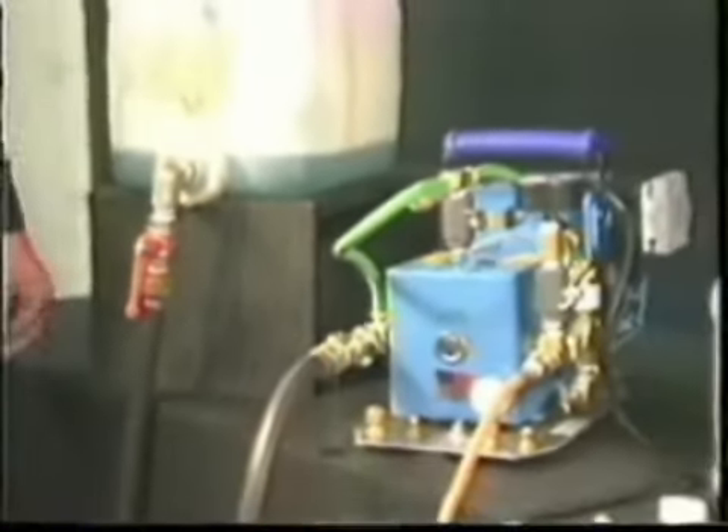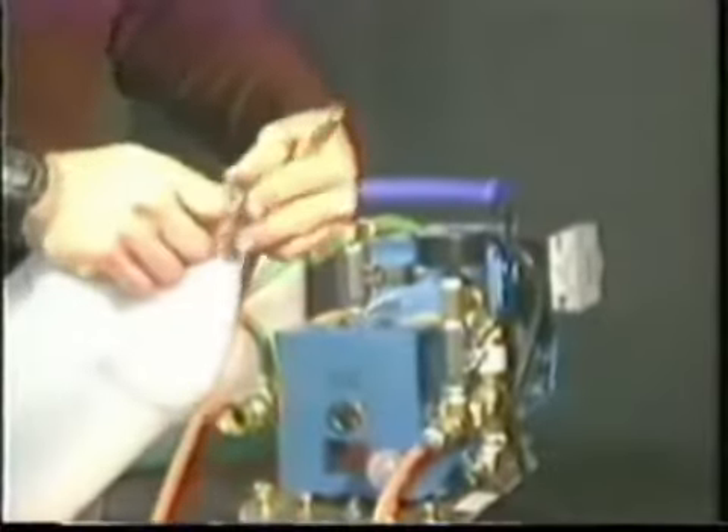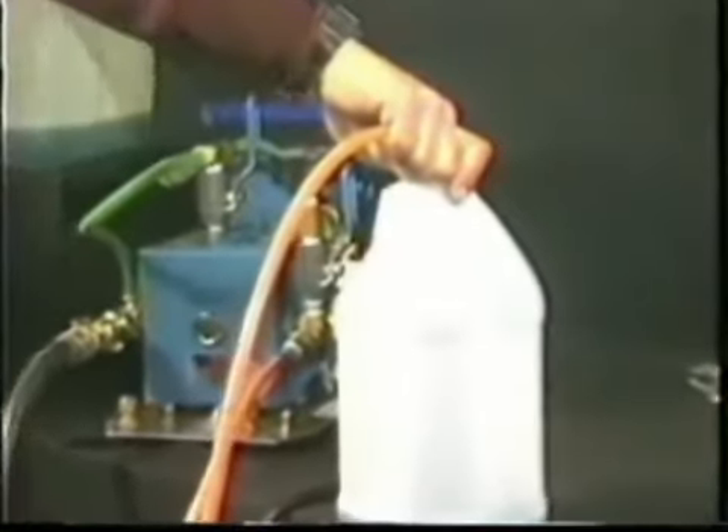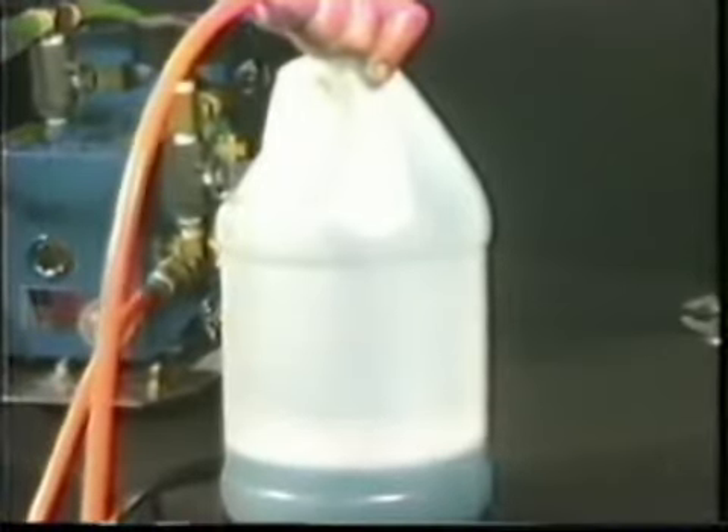When operating your jetter during the winter months, it will be necessary to winterize your unit with antifreeze. Use automobile antifreeze mixed according to the temperature guidelines for your area. Operating your pump with water frozen in the hose lines can cause the pump to overheat, and frozen water in the pump will crack the housing. Place antifreeze above the pump and hook the garden hose to the inlet assembly running from the antifreeze container — the Mustang 5-gallon holding tank is perfect for this job. Place the outlet hose in an empty container if you wish to winterize your entire system; otherwise, disconnect the outlet hose and collect the antifreeze as it comes out of the snap coupling. Holding the outlet hose firmly into the container, switch the pump on and cycle the pulse control and pulse eliminator valves. Turn the motor off and open and close the petcock valve. Do this after each use whenever water may freeze in the lines.